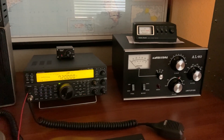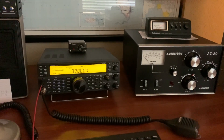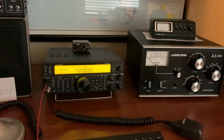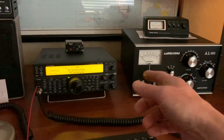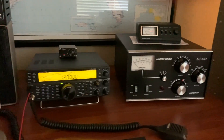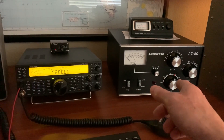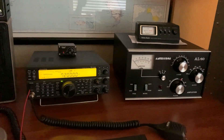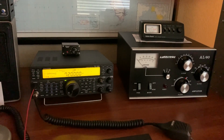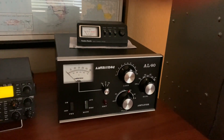This thing may put out more power down on 80 — I haven't checked it yet. But on voice peaks on single sideband, I get about 200 to 400 watts average on peaks, which is normal, because 800 watts CW — you're going to get about half on phone. If you have amplifiers with the pair of 3-500Zs, it's double that: 600 to 800 watts out on peaks and 1,500 to 1,600 watts out on CW. But this little amp is perfect for me.